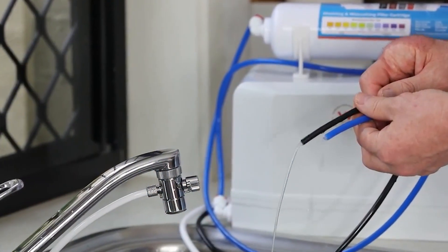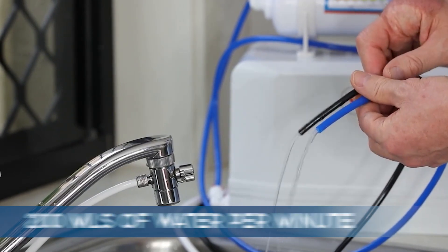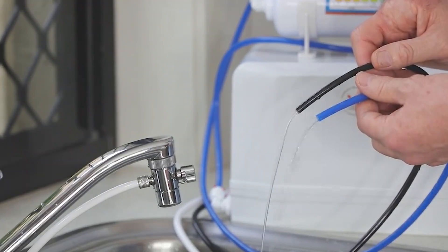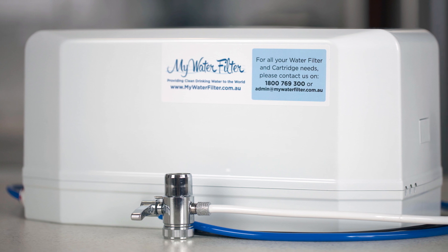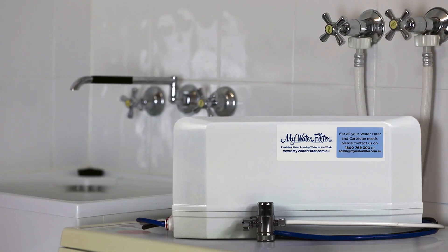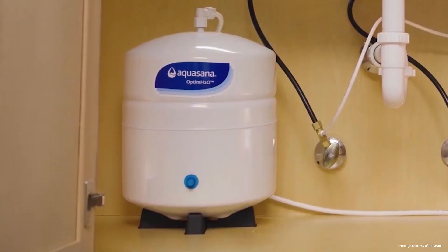Because RO water is filtered down to such a fine micron, it is slowed down to around 200 mils per minute. Because this form of filtration is so slow, if you go for a bench top reverse osmosis system, you will require a container to fill to store your water to decant off later as you require it. Bench top RO systems can be installed anywhere there is a faucet, like the kitchen, laundry and even outside. The under sink RO systems have a storage tank with them to store the filtered water. The most common reverse osmosis tank size is around 12 litres, and the tank ensures there is always water stored ready to use at any time.